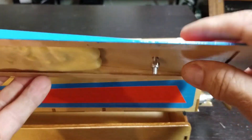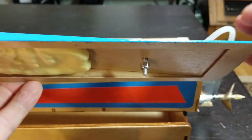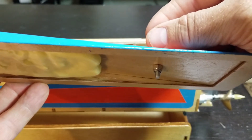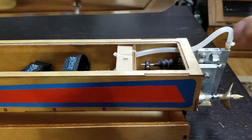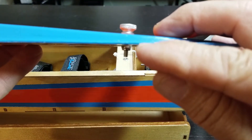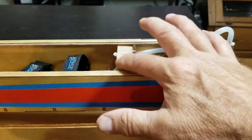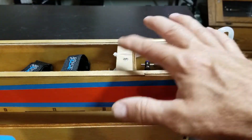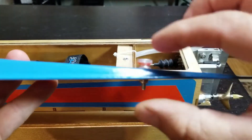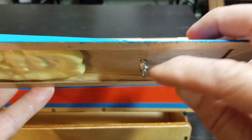The way to set these up is you want as much room above the nylock nut as you have engagement into the internal thread. So as you're unscrewing, it has to have room to come up out of the internal thread. To set the height of the internal thread, I'm looking at this measurement from the bottom of the cowling to the thread — how much thread is hanging out — and that's how I set the height when I epoxy that piece of birch plywood in. The other part is I'm not tightening down and crushing my cowling; it's bottoming out against the nylock nut. It's set up that way.